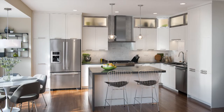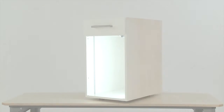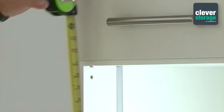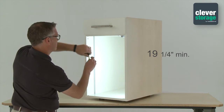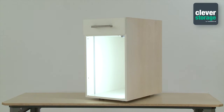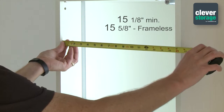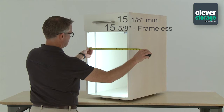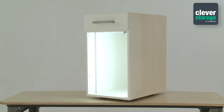This video is for demonstration purposes only. Please refer to the mounting instructions for the actual installation. The opening height requirement for this waste bin is 19 and 1 quarter inches minimum. For this reason it can be installed behind a full height door or with a door drawer combination. The opening width required is 15 and 1 eighth inches for a framed cabinet or 15 and 5 eighths inches for a frameless cabinet, which is what we're using today.